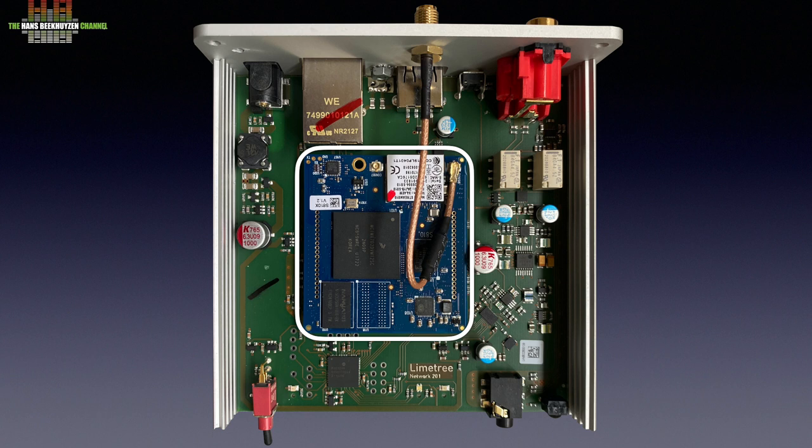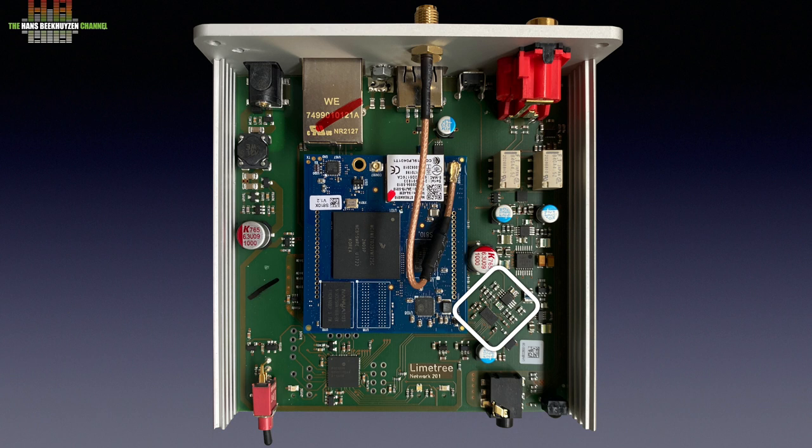The digital-to-analogue conversion is done with the ES9038 Q2M DAC chip, clocked by a MEMS femto clock specified at 500 femtoseconds. MEMS stands for Micro Electromechanical Systems — very tiny devices that combine mechanical and electronic functions. The ES9038 has seven filters aboard that can be set in the Lindemann app. The volume control in the DAC chip is not used; instead an analogue volume control by JRC, based on a resistor network, is used. Output buffering is handled by a Texas Instruments op-amp, and two Fujitsu relays with gold-over-silver contacts take care of the mute functions. The headphone amp is the TI OPA1622.